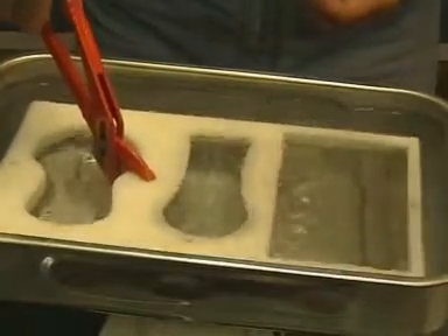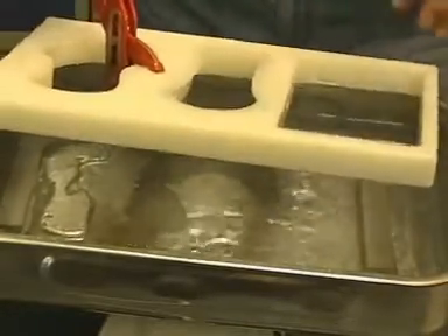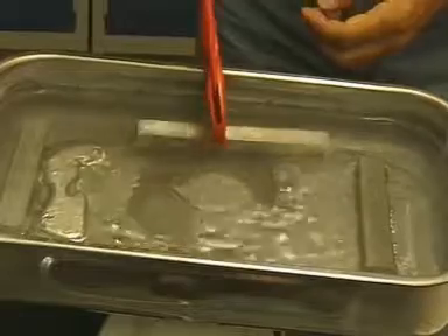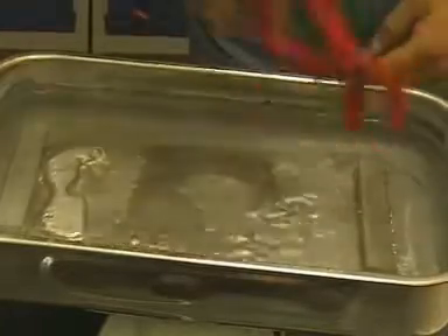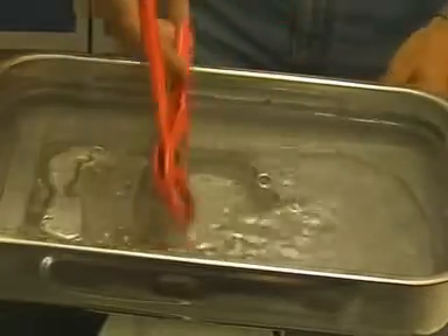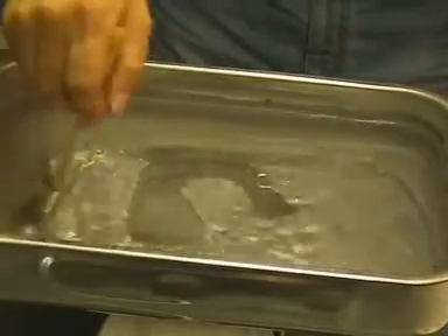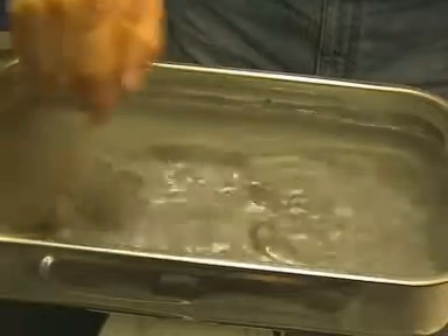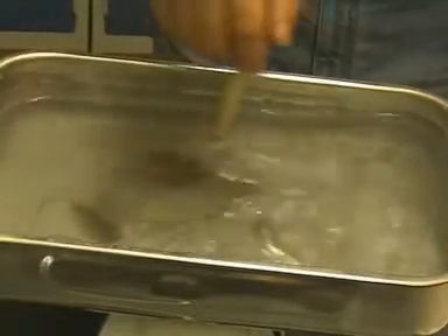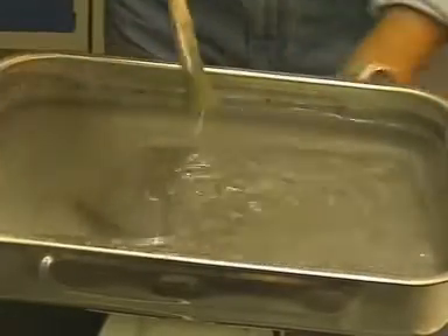The original raw material is removed from the water. All blocks used to prevent the piece from having direct contact with the bottom of the water bath are removed. The remains of the LM70 alloy are brushed into a corner of the bath to solidify into one lump for further use. The LM70 moulding material can be used over and over again without loss.